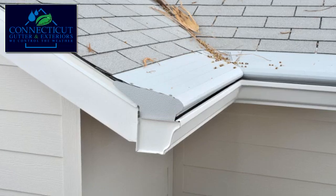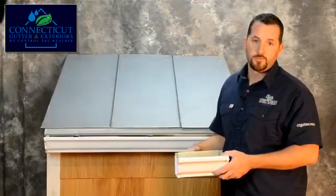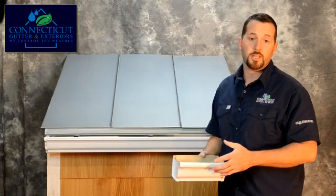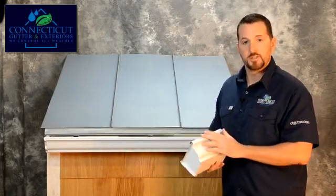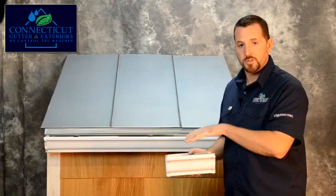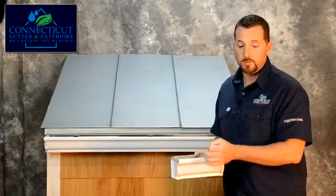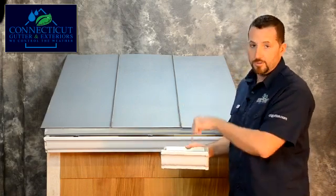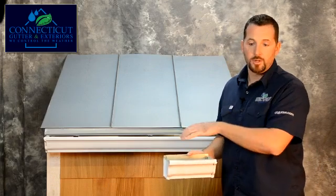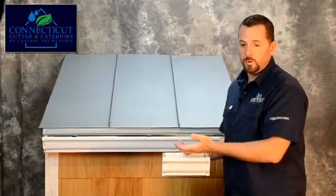A lot of problems there. Number one, the hood concept works off of the principles of molecular adhesion. In a laboratory, that works. If everything is clean and sterile, the surface of that hood is shiny and clean, the water molecules on a molecular level will adhere to the product, stick and make that curve and drop into the gutter. Not so much in a heavy rain or in a heavy water flow. In moderate to light, in a sterile environment, it will cling.